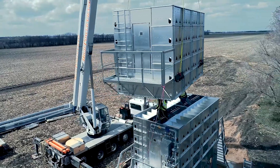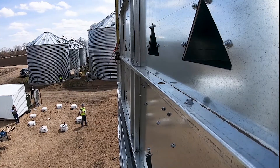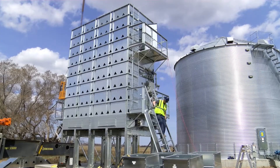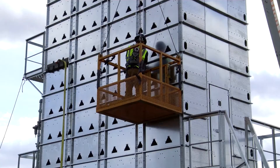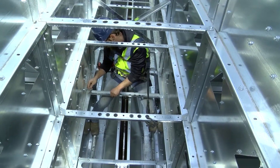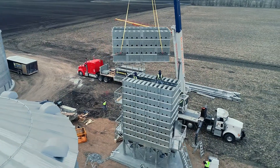The ladder is continuous up one side, so match the ladder up when orienting the dryer. Have two people standing in the inner column of the tub with alignment punches to guide the section down. Using tag lines to keep the section from moving too much, lower the section down lining up the flanges on the outside and the inside. From the inside, the punches will help guide the section into place as it comes down slowly. Once the inside flanges are set down and the outside flanges set down without any obstructions, you can fasten the sections together. On the outside, a man in a man basket can go around the outside and put bolts in the flanges and also remove the lifting brackets from the section just set. On the inside, install the plenum cross bracing in the same pattern as the sections below. Do the same for the plenum X bracing. On the outside, make the connection between the ladder sections using the ladder splices found in the connection kit hardware box. Repeat this process for any additional intermediate tier sections.